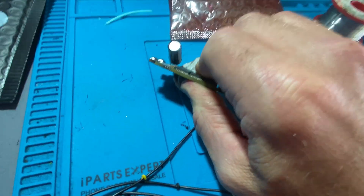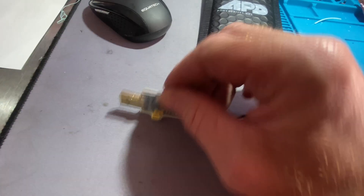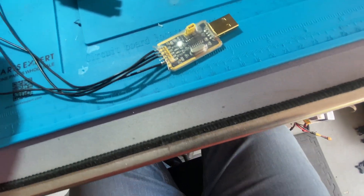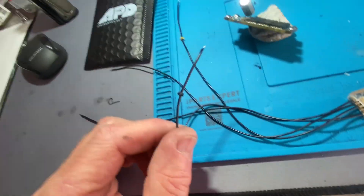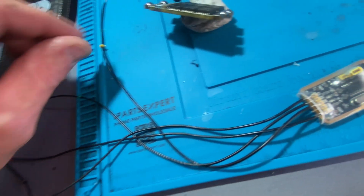So what we've got here — I'll put up a circuit diagram — 5 volt RX, TX and ground. And here we've got a CP2102 UART to USB interface. Don't use the wire that comes with them, they're a nightmare. Get some nice silicone, identify your live, identify your ground. I tie a little bob on and then RX and TX.